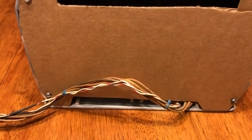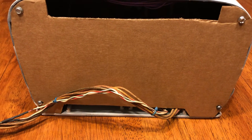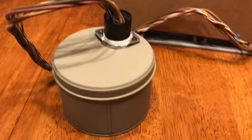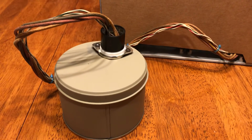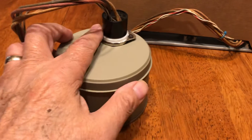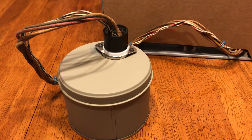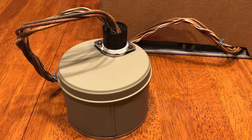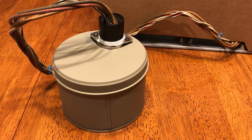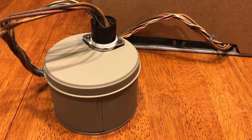What I did was take the batteries from inside the case and put them in a small can that will act as my battery pack. Basically, I took a small tin and attached to it a tube socket that would adapt to the plug coming out of the radio. Inside the can, I've got both my string of nine-volt batteries and also the one-and-a-half-volt battery.